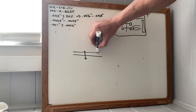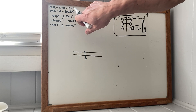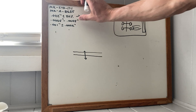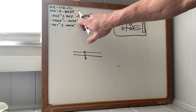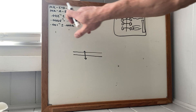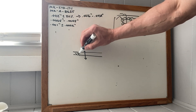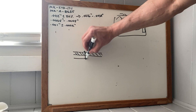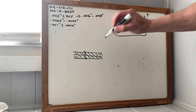On that two thousandths, which is the default, the spec gives a possible range that still satisfies Type 3 hard coat of five tenths to four and a half thousandths when specified. When not specified, you default to two thousandths. Half of it is above the original surface, half of it is below.